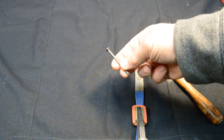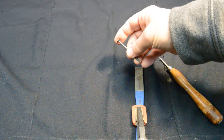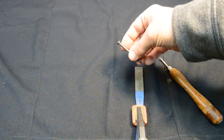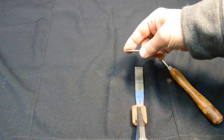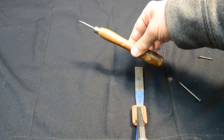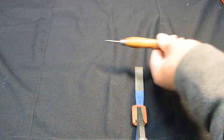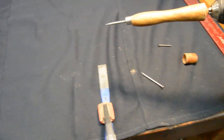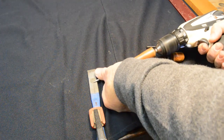I started out with concrete nails. Basically I would grind the head off — I tried hacksawing the head off but these things just laughed at my hacksaw, so I went to the grinder instead. Grind the head off and then do a rough rounding of the pointy end. When I'm done with that, I go ahead and do the turning to assemble the tool. When I'm all done with the tool, I chuck it up in the drill.